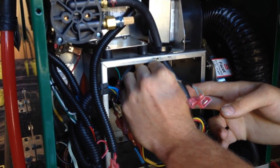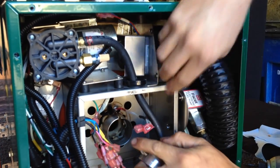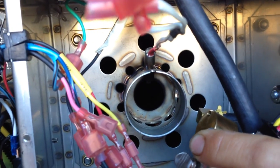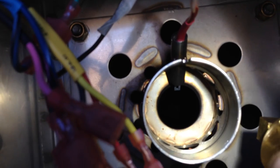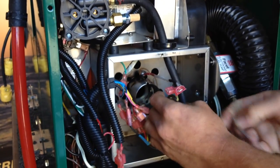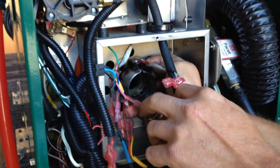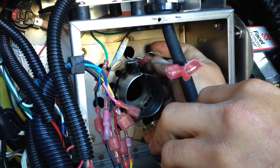Stick it down in there, and once it's in, we can always look down in the burn tube as well — just to make sure we see that horseshoe shape of the igniter in there. Use a flashlight so you can see a little better. Then we're going to reinstall our pin. There's a hole on each side of that igniter holder. When putting that pin in, go through one side and angle the pin upwards, go past the igniter, and find the hole on the other side.